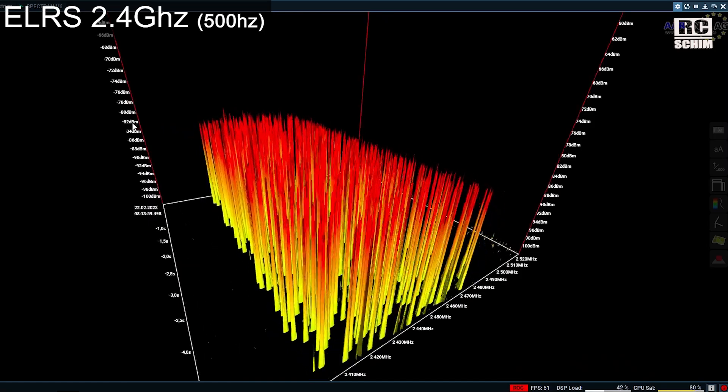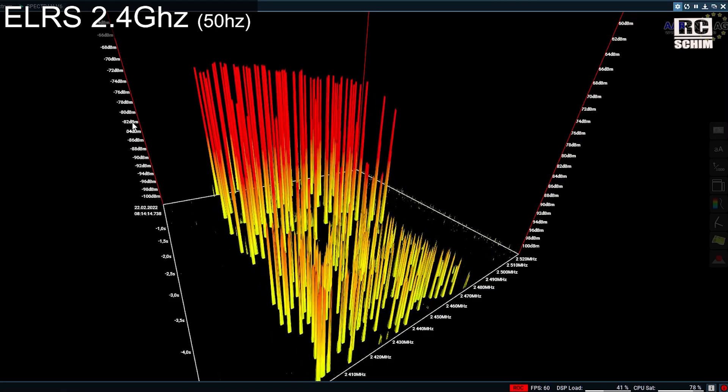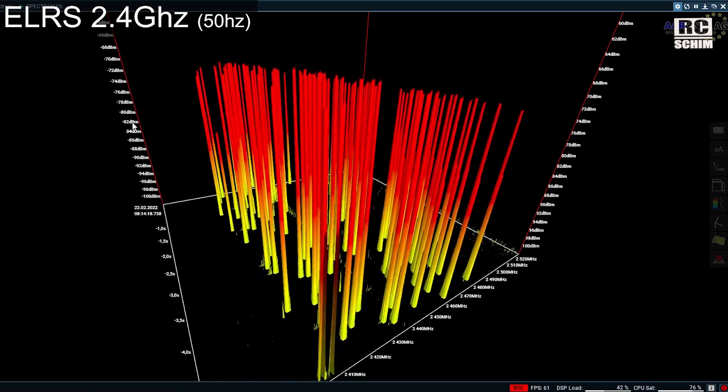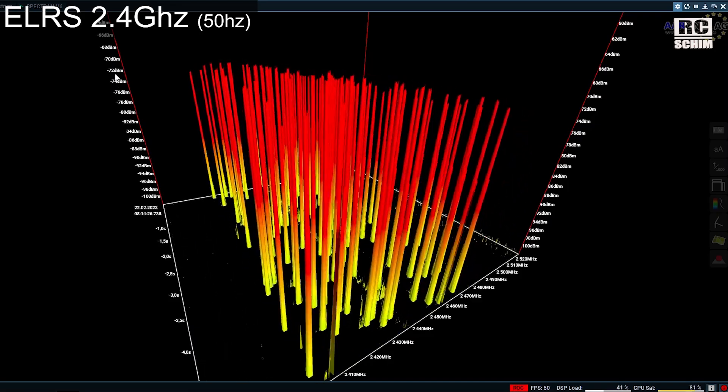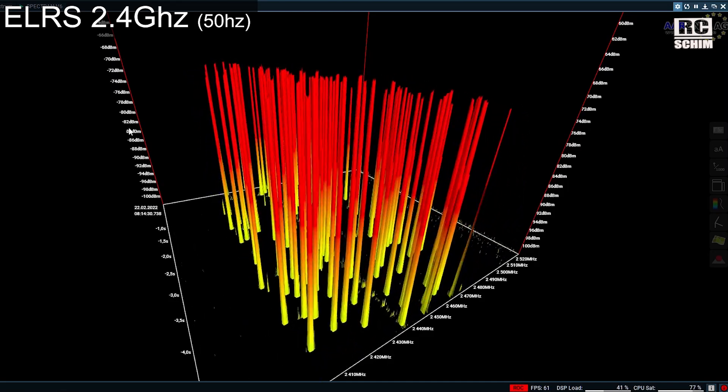Just for comparison, we are at roughly minus 82 dB. I've moved the packet rate to 50Hz — 50 instead of 500 — and you can see it moved from 82 dB to 72 dB. That may not sound like a lot, but every 6 dB you have double the range. So even 50Hz mode is totally fine for flying long range, cruising, or gentle flying. Don't go crazy high at 500Hz just because you need the best — it will give you a higher chance of a failsafe. Only use higher modes if you really want to decrease your overall latency from gimbal to eye.